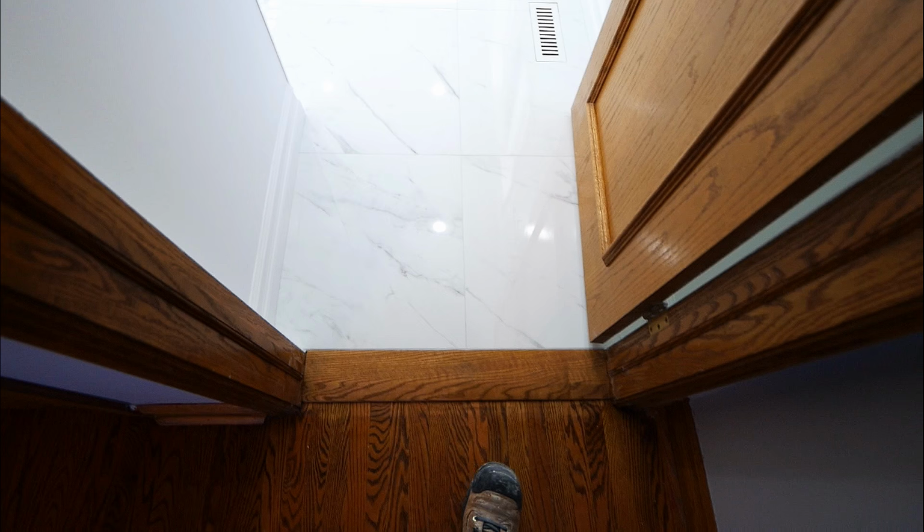Unfortunately, in this house specifically, their flooring was only 3/8 inch thick, which is really, really thin. And our new bathroom floor height is at 1 inch. So if you think about it, we had a 1/4 inch of plywood, a 1/4 inch of Ditra heat, our floor tiles 3/8 inch thick, and then some thin set that's about 1 inch finished height. So to bridge the gap from 3/8 inch to 1 inch, you have to do something a little bit drastic.